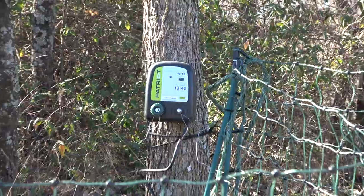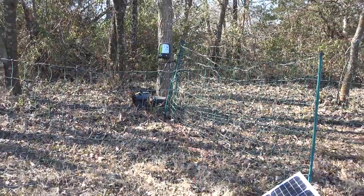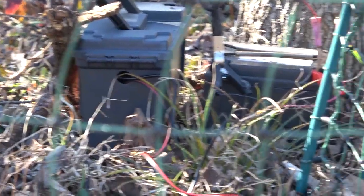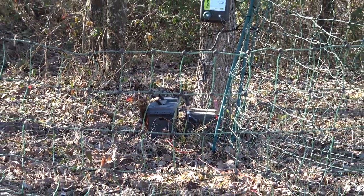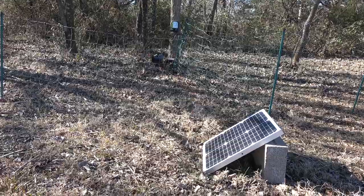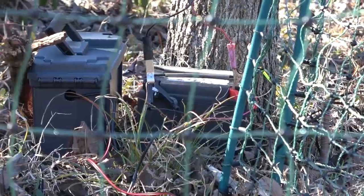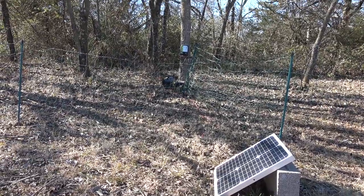Some of you may have noticed I've got this electric net around my apiary. I just put a solar panel on it with a charger — the solar controller is in that little box and there's the battery. It keeps the battery topped up; before I'd just swap batteries out and recharge them. I thought I'd add this solar setup this year. It was 44 bucks for the panel and solar controller, and they give you a few wires and battery clips. I'll put a link below. Pretty good price to add solar to your energizer.